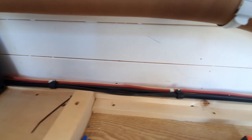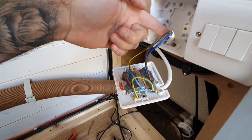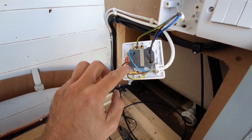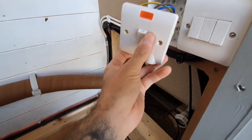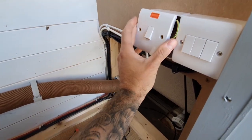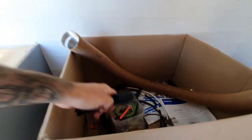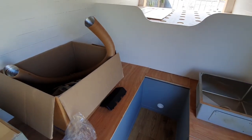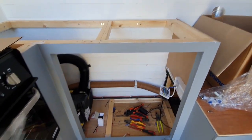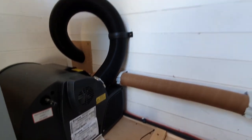We're wired in, clipped down the back. There's the heat shrink and we've wired into this double pole switch. It comes in from the fuse board at the back into the top of this 20 amp double pole switch, then the output is wired into the outgoing side. When connected to mains this switch will light up and give that bad boy 240 volts. Next job is to try and work out where to put this temperature sensor - I think I'm going to fish it along the back with that conduit and try and get it up high. Then all I've got to do is get that dropout vent done and the last bit of ducting, and it's in - obviously not the water and gas yet.